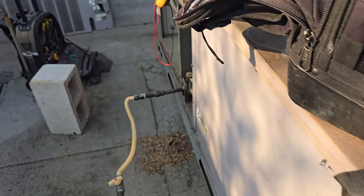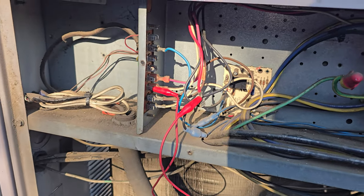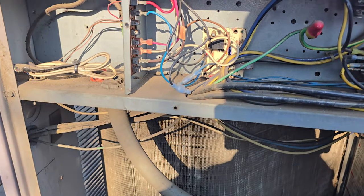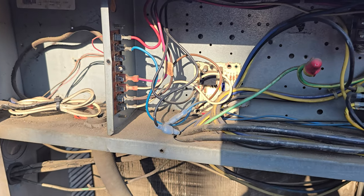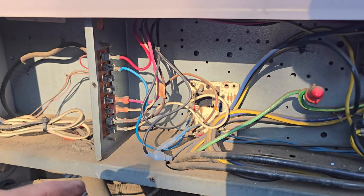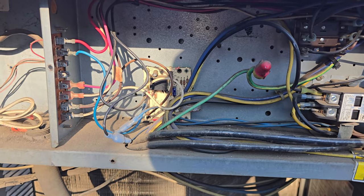At this point it's time to go ahead and start this guy up. We're going to turn it off and then we're going to connect the thermostat and let the thermostat do its magic. Let's see if the thermostat — actually I think I've got to go downstairs and set the time on it. So I'm just going to jump it out from up here. Indoor blower motor started, so that's a plus. At this point I'm going to connect to Y1 and then jump it out, and we'll test the thermostat's operation here in a few minutes.